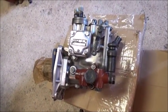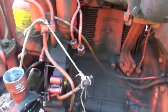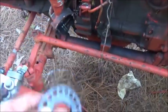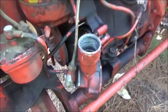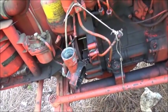We're going to get this thing on, get it in time — I'll show you a bit of how to time it and get this thing running, hopefully on two cylinders. First thing putting this pump on: clean up the gasket surface, get the new gasket on, get the pump on, get all the lines hooked up. This piece slides over the end of the pump, you put the bolts in, and it's got a bracket that runs the tachometer — that's how you time it. You can see all the holes all the way around that bracket, so you have a lot of timing mark options.